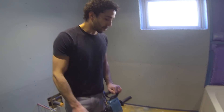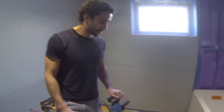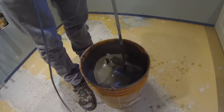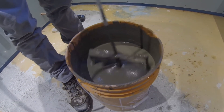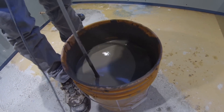I'm going to let this stand for about a minute or two and then give it a final mix and start applying it. When you're doing your final mixing before you're about to start pouring, make sure to manually scrape all the sides because there will be dried-up bumps. The consistency should be that of a runny milkshake.